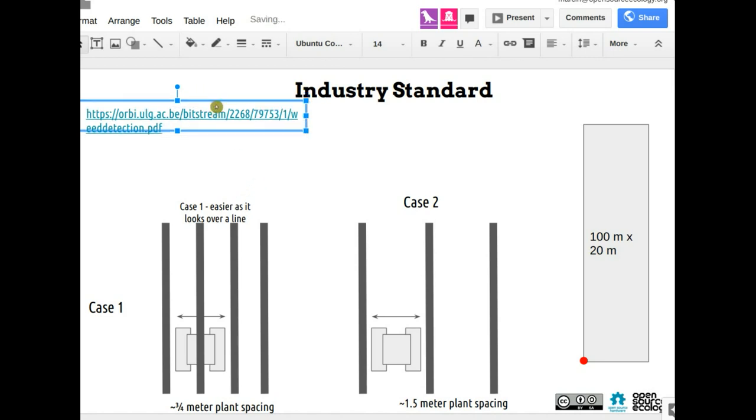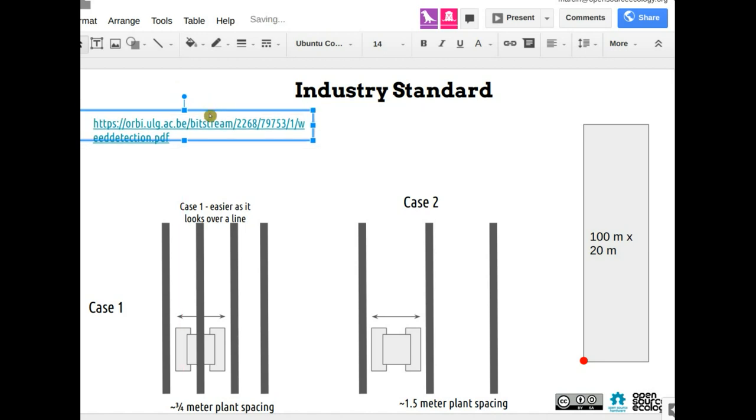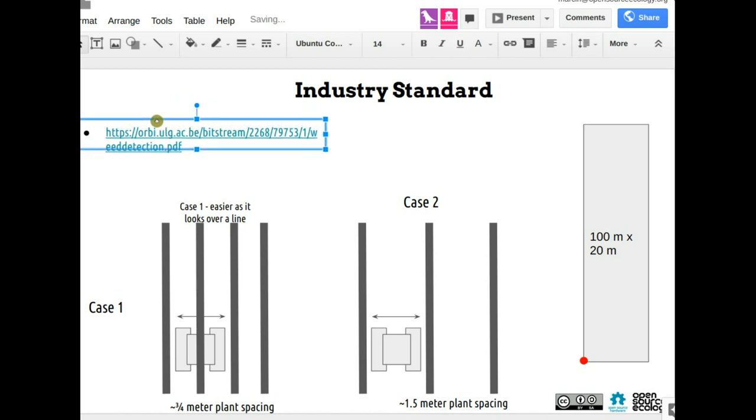Yeah, and it's a little different strategy because they're actually detecting weeds. Here, we're detecting markers, which is simpler. So we're using vision in a much simpler way. What we're doing is merely trying to understand colors and counting pixels. And what he's doing gets into machine learning, in which we need to get patterns of plants, training a classifier on how to detect certain parts of plants.